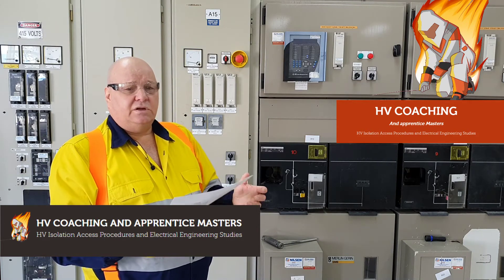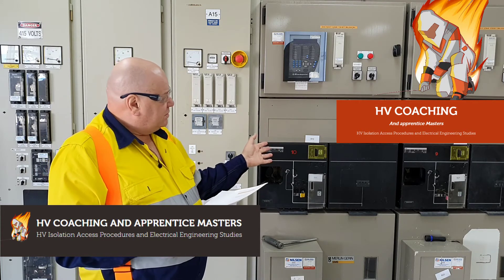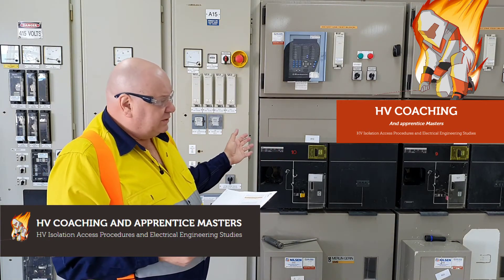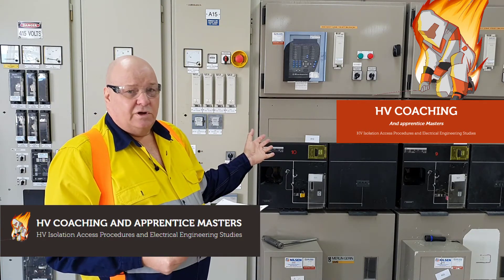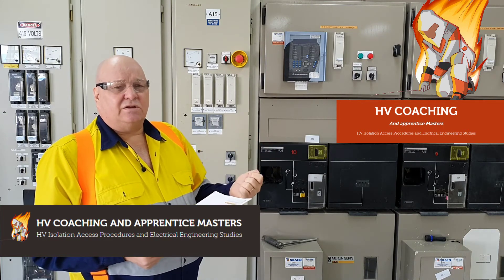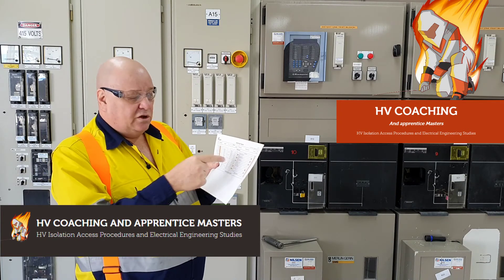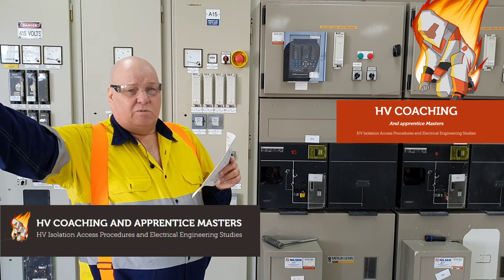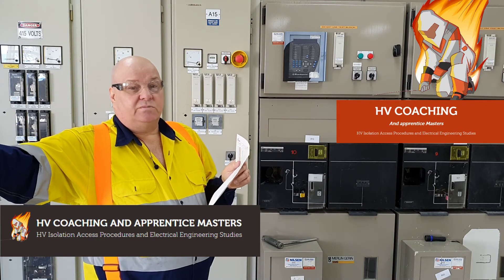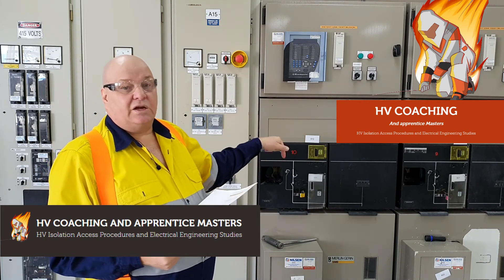It is also the switching assistant's job to go in and make sure that the equipment has switched and stayed switched. There is some old gear out there that when it switches, you've got to make sure it doesn't flip back from the cam. They make sure the contacts are actually open or closed. You can't do that with the hood on, and there's no point taking the gloves off and the hood off to get a torch shining through a viewing window to see if you can see the contacts — that's the job of the switching assistant, which is why it's a separate action on the switching program. The operator will operate it while the switching assistant stands out of the way, then comes back in to check that the correct switch was operated and is actually open or closed.